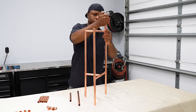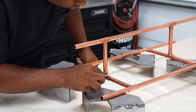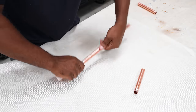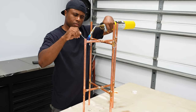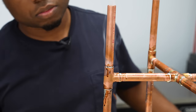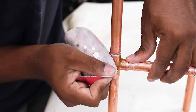Initially I was planning on gluing all the fittings together, but there were two parts I needed to solder so I figured I'd just solder the entire thing. I tried a few test joints without adding solder and flux and that didn't seem strong at all, so I went back to basics. I sanded the tip of the copper pipe that would be inserted into the fitting, then applied flux to the sanded area and connected the parts. Soldering copper joints is not something I have experience with — some joints came out good and some needed work, but all in all the joints seem pretty solid. I was going to paint it black, but as I was cleaning it up, I believe I'm going to leave it as is.